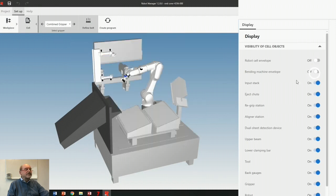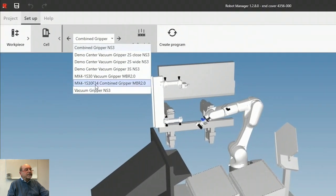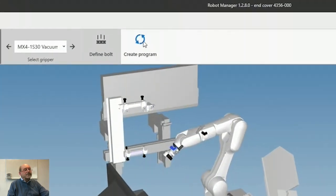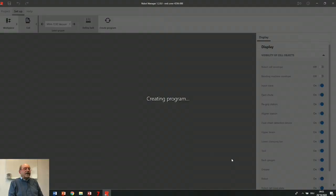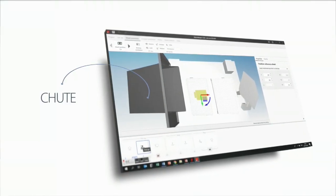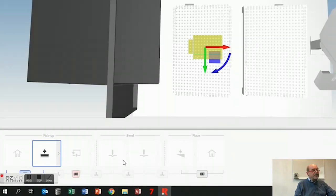Normally I want it like this — this is the easiest to program. So what I need to do here is to choose a gripper or a vacuum cup. That's what I did, and then I make a program. I can verify all this. I don't want to do the dual sheet detection — I know that my parts don't stick — so I'll create a program and it will now make blocks. For this program I need two blocks for the bending, they're right here at the bottom, and then home position pick up, that's where I am now, reference and drop it in the chute.